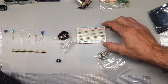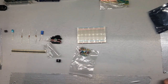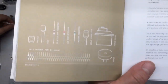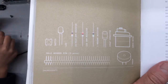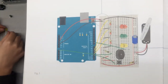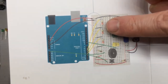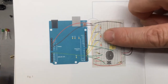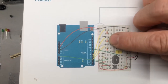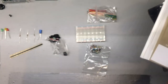That's the unpacking and setup — I think we have everything we need to move forward. Our first lesson: always read the instructions. When we flip to the next page, it's not just one LED — it's three LEDs of different colors, and each requires its own resistor to protect it. If we powered the circuit without resistors, the LEDs would fry.